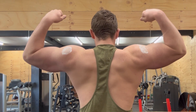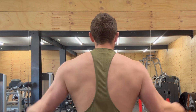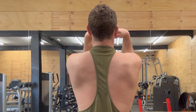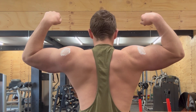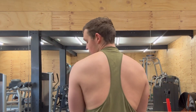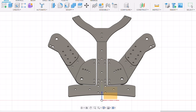Another reason for that pivot point to be at the bottom is so the brackets can move out and wrap around with the shoulders, but also contract into the center of the back to allow the shoulder mechanism to rotate around to face the back. As you can see from the chalk marks on my shoulders, as I move my arms around any part of the back piece has to extend to allow the shoulder pieces to rotate. This isn't possible if the pivoting mechanism is higher up — it all gets jammed. This is why you'll see a lot of commercially available exoskeletons using this type of design.